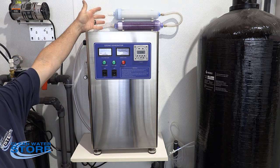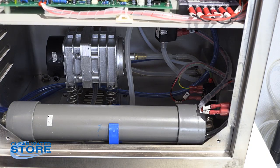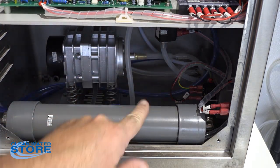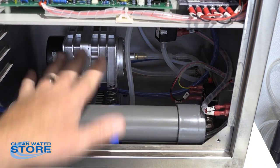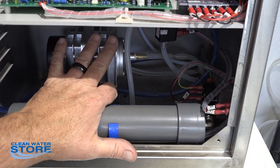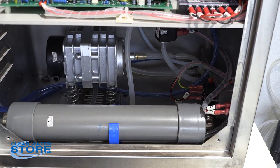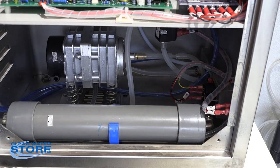If you're going to use it as a bubbler, you'll have your external filter drying cartridges, and we'll show how to plumb that in as well. I have the back of the unit removed. This here is the pump that actually produces the pressure. Operating this switch — this is a dryer, it's electric, so it actually heats up with a heating coil inside. So you can use this system without any external filters as a bubbler just the way it is sent to you. The inlet is at the bottom. If you do wish to add the external filters, we do recommend that, as we really don't know the condition of the filters — you can see the color change on them.